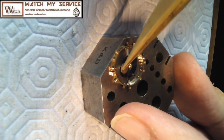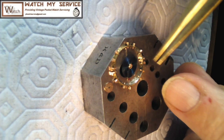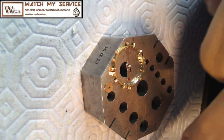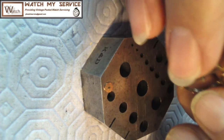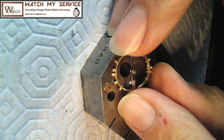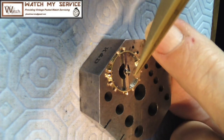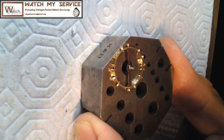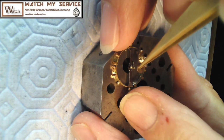That configuration is kind of upside down right now, so it would be on the bottom. All I need to do is make sure that the impulse jewel is on the left side of what I'm looking at right now, but of course installed the other way. I'm going to flip the balance staff around to the position it would be within the watch as I install it. Then I've got the roller table on there and it would just go right on the top. Everything goes ping - that just flew off my tweezers onto the table. I haven't lost a lot of things lately but I did lose a screw today.